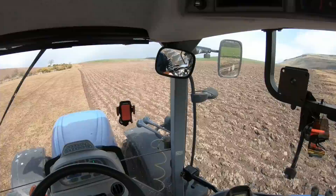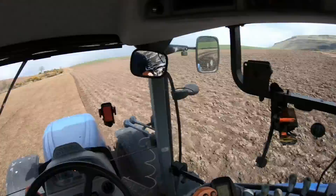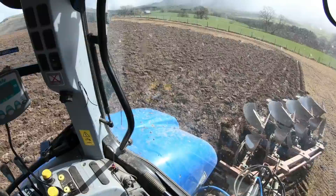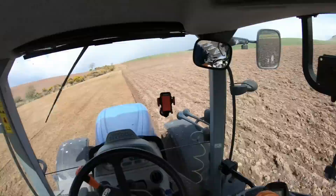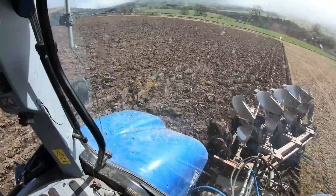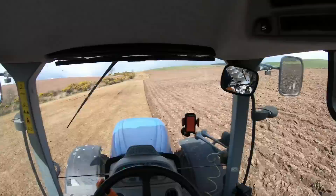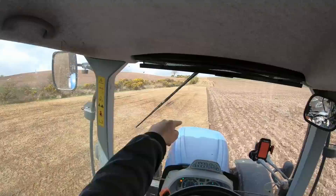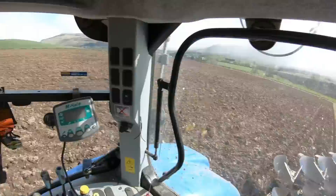I'm back in this grass field and I'm going to be ploughing it of course. I'm getting towards the edge of the field where it's starting to do this big C-shape. What I'm needing to do is, I'm actually working off the tram line of Dad's spraying the field off, just to make it easier for me to turn at the ends. You can just see the dips of where his sprayer's been and I'm going to the outside line of that, lifting the plough out, and then driving straight up and dropping it in there — just means I get a nice long sweeping headrig.